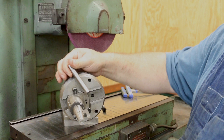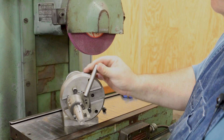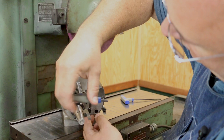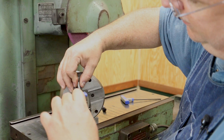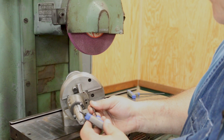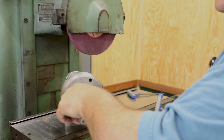That little rod was missing in action — it didn't come with one. So I measured it; I think it was 13 millimeters. I ordered a piece of drill rod, cut it off, and voilà — I've got my missing part. I need to cam this thing around so it's holding that piece in place and tighten it up. There's also a little set screw here that tightens a ball/spacer on the gib, which keeps it from moving around, so now this is very stable.